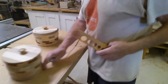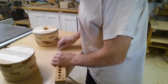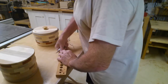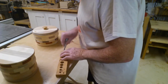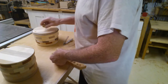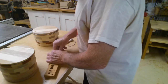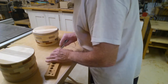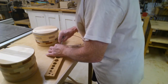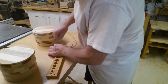I'm going to bring it over to the drill press and drill the hole. I'll slide my jig down to a different hole to hold it in place, or else use a pair of pliers, because I don't want it spinning and I can't use my hands — it's just too close, it's going to slide. So I have to use pliers.